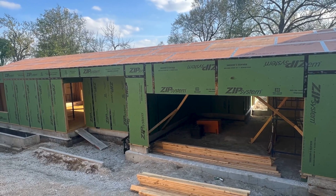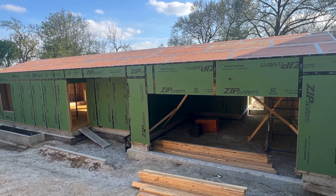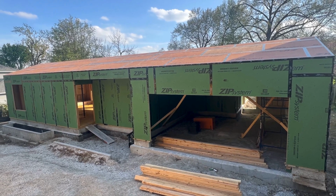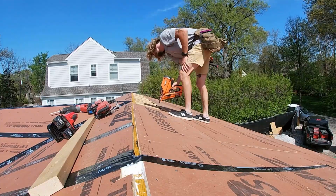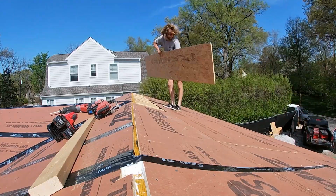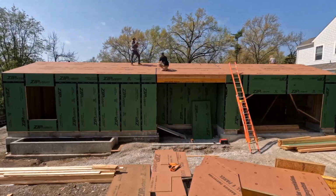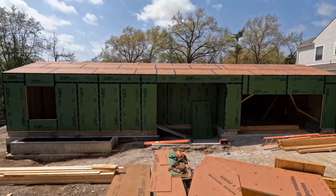I think that's brilliant. We're a huge fan of making that simple connection of wall to roof, exterior air and water control. But by having that monopoly framed condition where the exterior sheathing on both the wall and roof are our air and water control, taping that seam, we invite a problem.